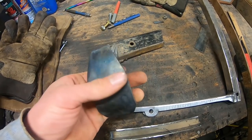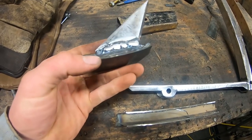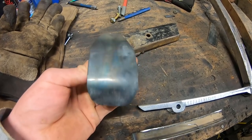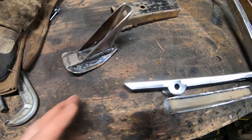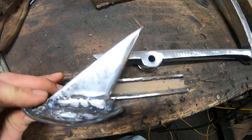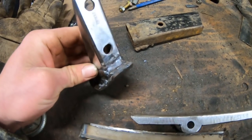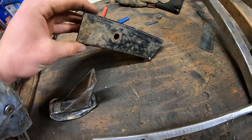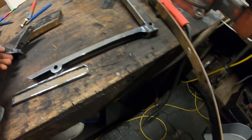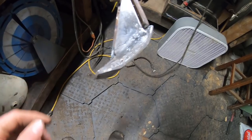I think I have both feet done — I'll be adding rubber as a final touch, but all the metalwork is done. I started with a piece of 2 inch by 1/8 inch flat bar, bent it into a curve, and cut out a teardrop shape mimicking the commercially available feet on pre-made jump stilts. After I had that plate figured out, I used some leftover material from lightening up the square tubing, put the rounded shape against the edge, traced it, cut it, and welded it in place to give me a nice flat surface to mount the bracket to — made out of one inch by two inch rectangular tubing. I'm using grade 8 bolts to hold it in place because I don't want to risk this breaking at any point, and I think overall it'll be more than strong enough to do the job.